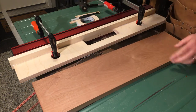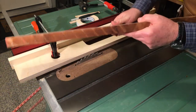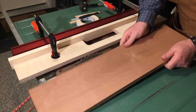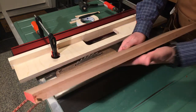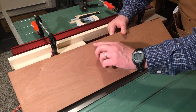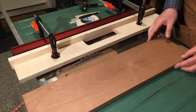So what we're going to do is joint this board, which has come from the lumber yard with a very ugly, uneven edge. We're going to joint this thing down to six and a quarter inches. We've got a nice flat square face here, thickness planed almost to the thickness we want — just a little over three-quarters of an inch thick. I've marked off six and a quarter inches from this edge over to this edge, and that's what we're going to cut off and joint.